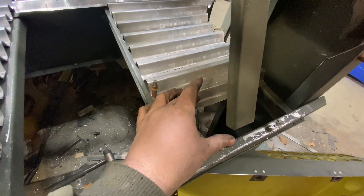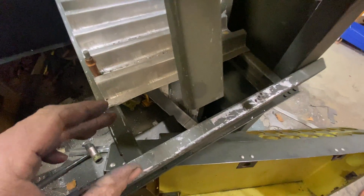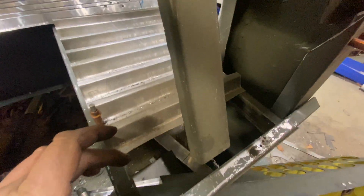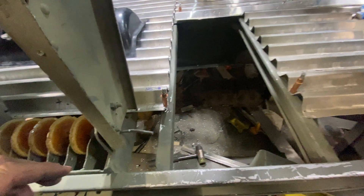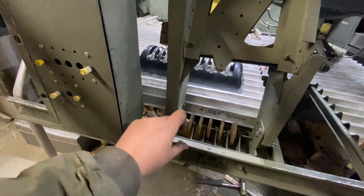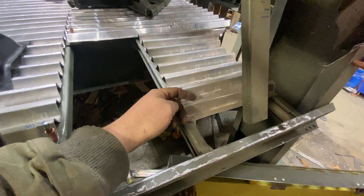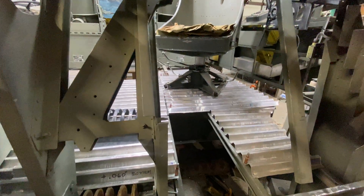Next up — because I need to do some riveting, I've been welding myself to death — there are going to be plates that come here, then a plate that doubles up here, then just a regular plate. There's going to be a hole here for the wire or cables for the TBS controller, big holes here, then a plate that these rivet to, continuing over to here. On the other side there'll be a hole identical to this side for all the wires for everything back in here. So it'll be plate-plate-plate-plate with a big hole down the back, and then the wall that terminates all this — and at the same time it'll have nut plates for the big cover fairing that covers the entire underside of the flight engineer station.